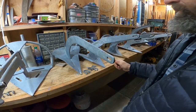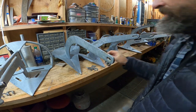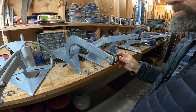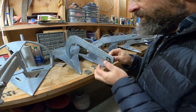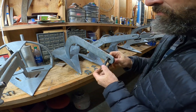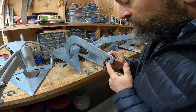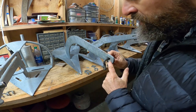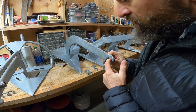This is the 45-pound galvanized steel Spade anchor, and a half-inch shackle will not pass. A 7/16ths shackle will pass, but not readily — you have to wiggle it until it's just right, and then it passes through. There is enough clearance so that it won't bind. It's not a generous amount of clearance, but it is enough. I'll note that the corner of the opening is not chamfered, and the galvanizing has been knocked away.